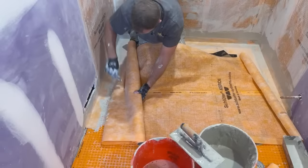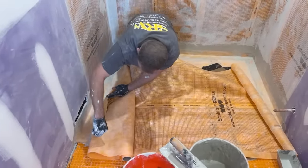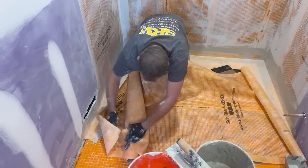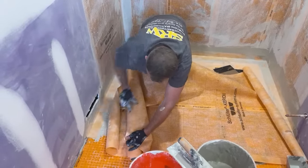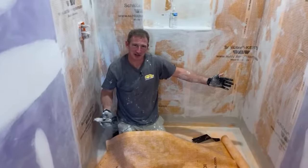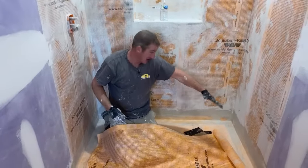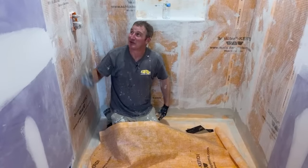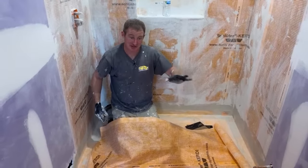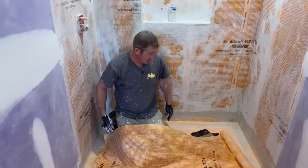Have you done a Ditra-Heat that heated the pan too? Yeah, absolutely. I got a video series on that on my channel. That's definitely popular. Great idea. Because believe it or not, a lot of people argue about that. Like, why would you put the heated flooring in your shower? As soon as you turn on your shower faucet, it'll get warm. Well, that's not really the case. I mean, you're definitely not going to be warm back here. Your shower head's only going to mainly be right where your body is at. So if you have a heated floor on the outside, I really do recommend you put it on the inside of the shower too.